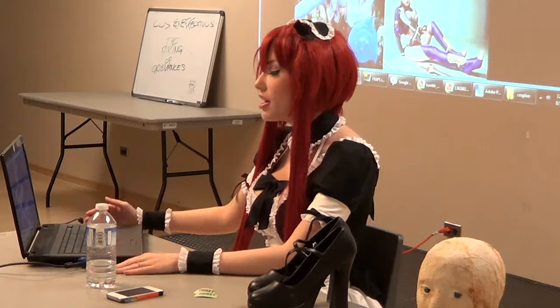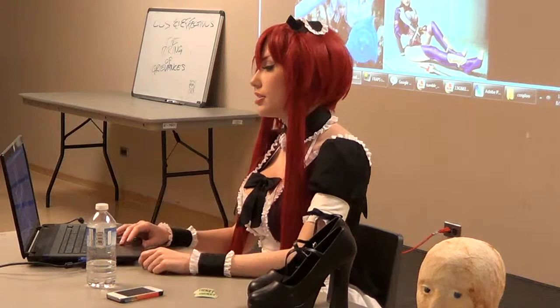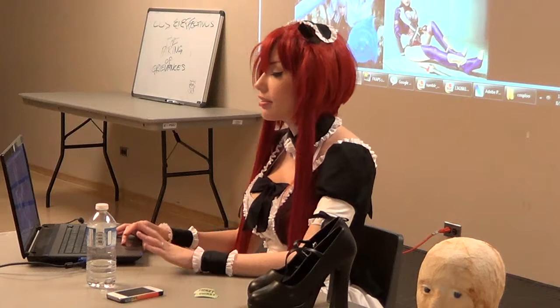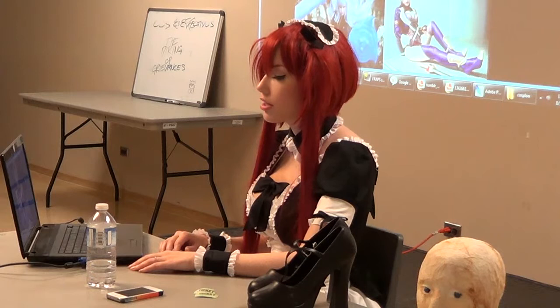But do you know how he maybe formed it? Yeah, the actual forming of it, you can do with just heat. But to get it cut really nice like that, you have to have a laser cutter, and that's how all the details are put in it. What was it made out of? This is just acrylic. Yeah, orange acrylic. So if you're doing something that doesn't have to be precisely cut like this, you can do it at home. But you can't really see it here, it has all kinds of little detail lines etched into it, and you have to have a laser cutter for that, unfortunately.